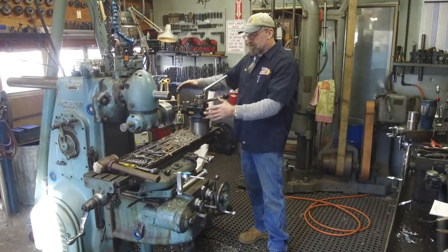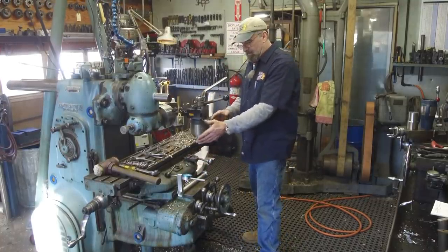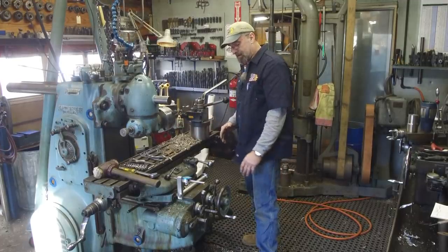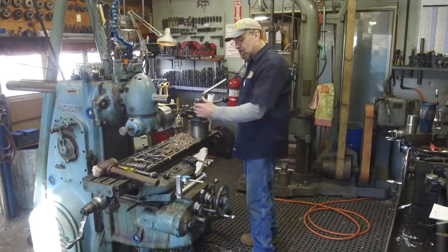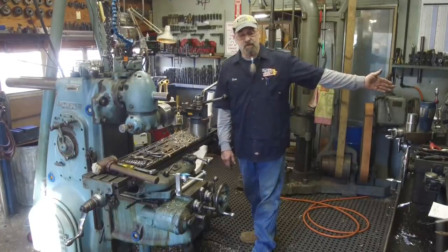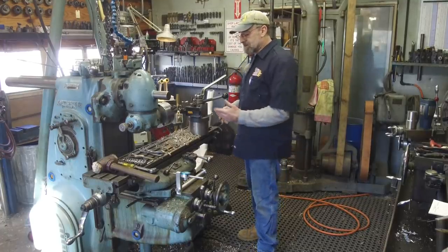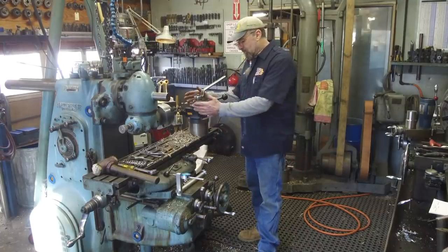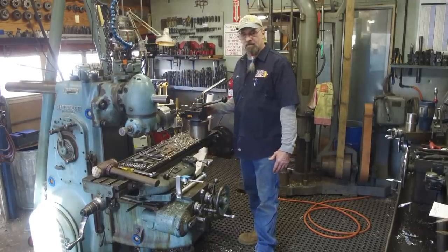So nice radiuses. I could turn the table. This adjusts on this 2HL mill is what this is, and the table can actually cock at running angles, so I can pivot the whole table right on the carriage. So you could do some tapering. Okay, I do have the taper or the tracer attachment over there, compound on the lathes. You have a lot of different ways of making tapers, so I don't know how much I would get into that, but bringing over the rotary table, setting the compound up on the rotary table, and being able to do spheres.